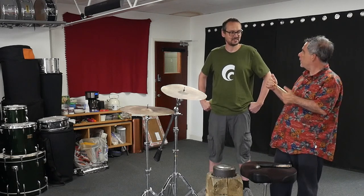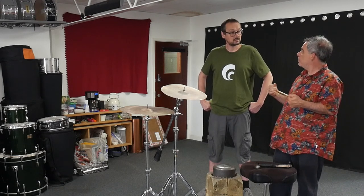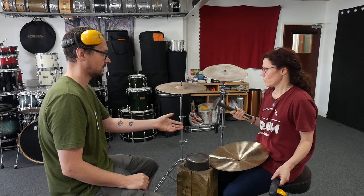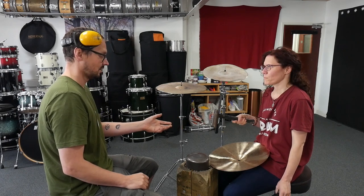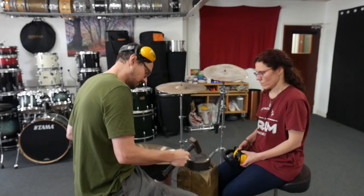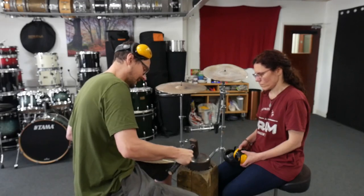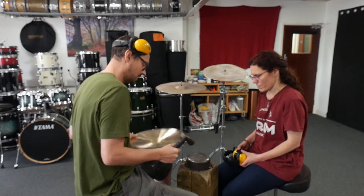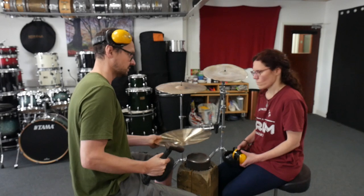Good. Cool. Okay, so let's get on with some cymbal making. Let's swing some hammers. Excellent. So you'll be using this. It's a Turkish cymbal hammer, and it's heavy. It'll probably take a bit like drumming. So this is basically coming up and down, and you see there's a flat portion on the anvil here, with just kind of aiming in there. And this hand is moving the cymbal.